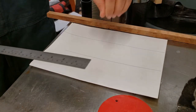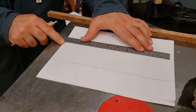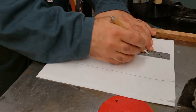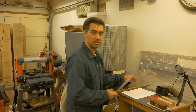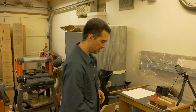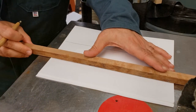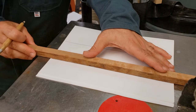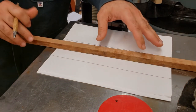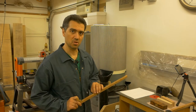What you do next is flip the paper over, and when you butt your ruler against the line edge to edge, if you can draw over the same line then you know your surface is nice and flat. Repeating the same with the piece of wood edge to edge, when I draw the line we can see there are gaps, so the wooden surface is definitely not as flat as the ruler.